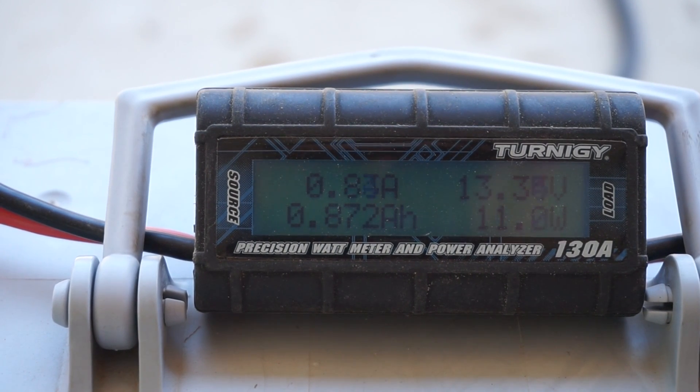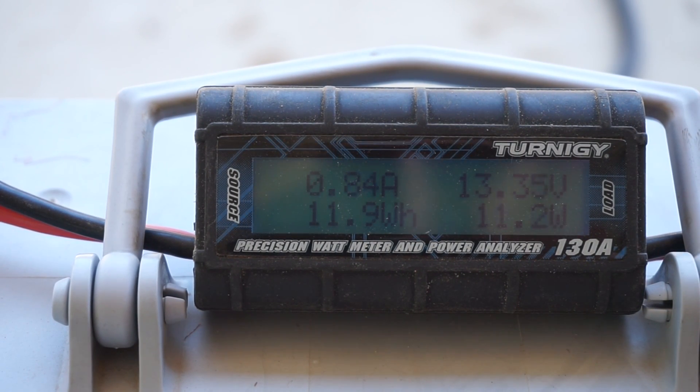That's about 10 watts, which is equivalent to about 75% loss. So when you guys install solar panels, we've got to make sure there's no leaves, no dust, no bird poop on there, because you'll lose a lot of power. If you have all these panels in series and one panel has shade, you're gonna lose a lot of power — if you have four 40 watt panels you're gonna get 40 watts instead of 160.